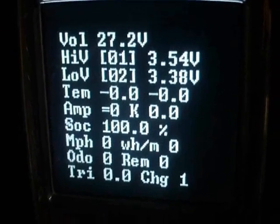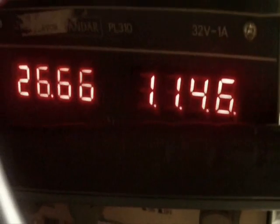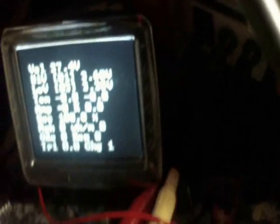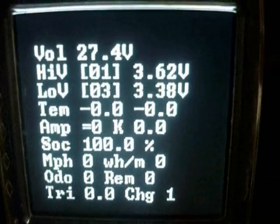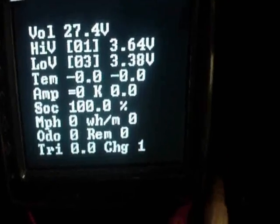It's got a lot of other features I'll go through a little later. We are charging — I've only got a one amp power supply capable of going to 24 volts to charge these cells. As you can see, we have a cell hitting 3.62 volts there. I'm not sure where the cutting points for the shunts are, but there we go — there's our first shunt cutting in.